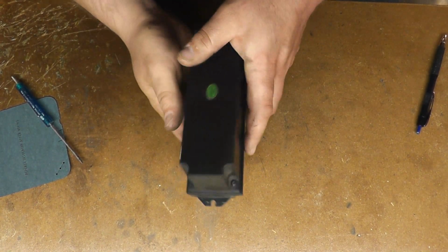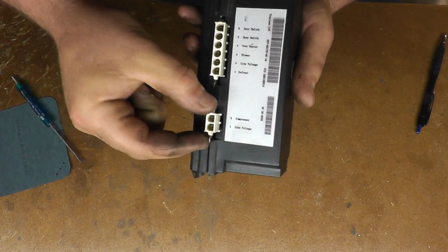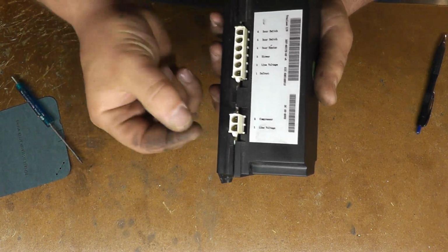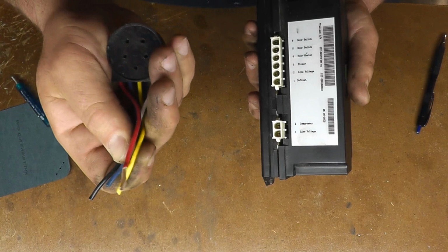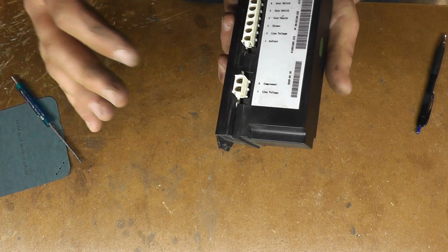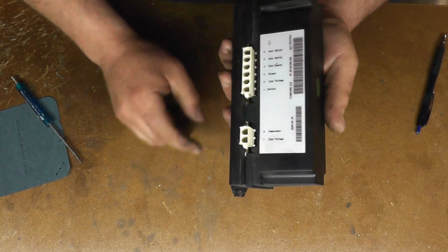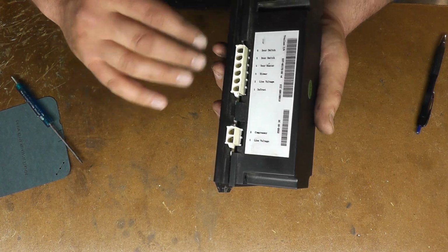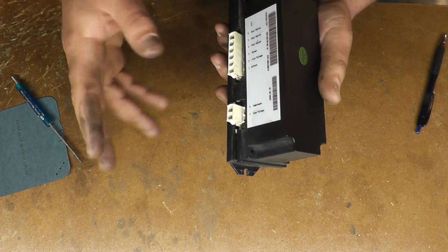The unit will shut off. What happens is there's an idiot clip that plugs into this, which is your compressor power in and out of the compressor. They use like 16 gauge wire. This wire looks like this. It's roughly 16 gauge wire, really thin in my opinion, but it's UL listed, so they get away with it. And especially from not cleaning the coil, or a condenser fan motor dying or something along those lines, one of two things will happen.